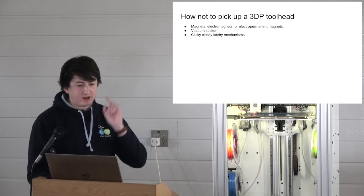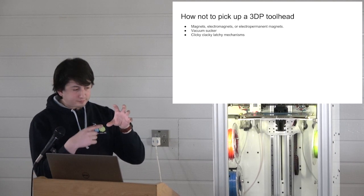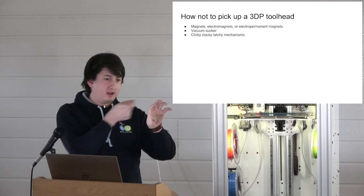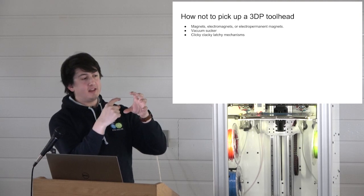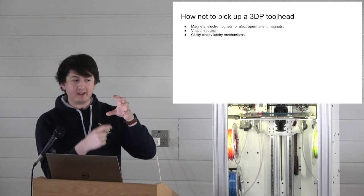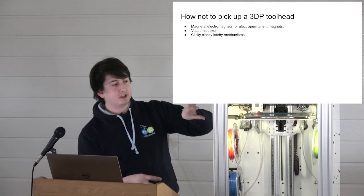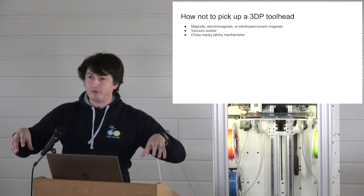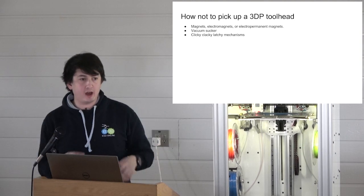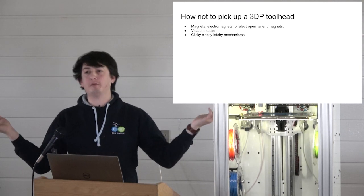One thing that I had really close to my heart was the vacuum grabber. It was basically a plate with a quick detach fitting on the back, and then there was a gasket made of silicone closed cell foam, with the kinematic coupling elements in there, and it would go up to the tool. This is how they move panels in automotive production with these suckers, and lots of conveyance is done like that, like silicon wafer conveyance. So I was like, that's the way to go, right?